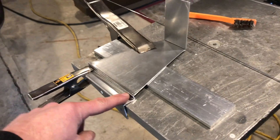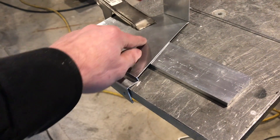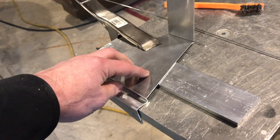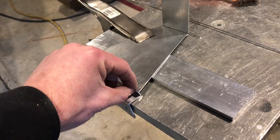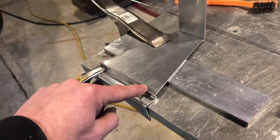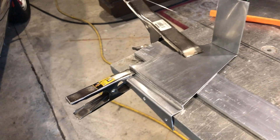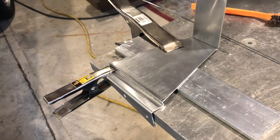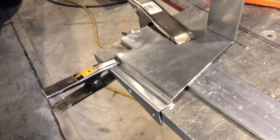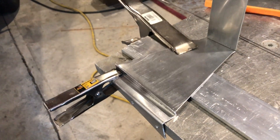The first things to note in welding this thin aluminum that I've learned: if you're trying to weld out in a flat area on this thin stuff, you're going to get heat distortion in most cases. I always try to position my welds close to bends like a corner. If it's in a panel on a car, I try to place my welds at high crown areas — those are easier to finish. In the high crown, the spring in the metal absorbs and restricts the heat distortion.